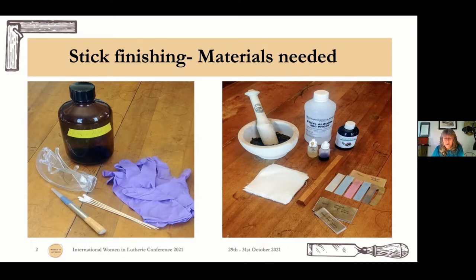To prepare French polish, add equal amounts by volume of shellac flakes and alcohol, let it sit until dissolved, stirring occasionally, and keep the cover on the jar so the alcohol doesn't evaporate. Something not traditional but done by many makers today is to add a tiny pinch of ground gum benzoin, which gives a little extra shine to the finish. If you add more than just a tiny pinch, it will look like plastic, which is very disappointing.